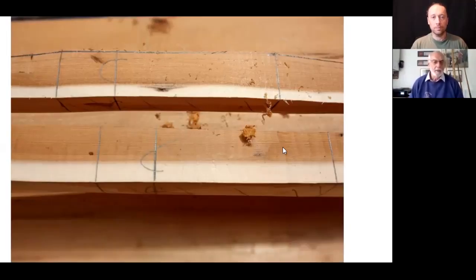Now, a lot of modern longbows are laminated, and they will use either hickory or bamboo instead of the sapwood to give that tension property. And a different heartwood, generally either lemon wood or osage orange; yew can be used. So that's a laminated production, whereas this self-yew bow just has sapwood and heartwood. So you've got those two ideal properties in one wood, and along with its natural springiness, it's an ideal wood if you can find something that's not full of knots.